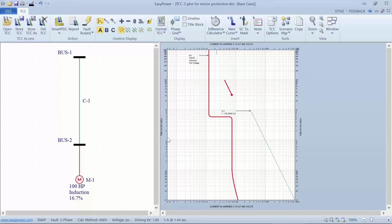If I look at my log scale over here, I see 1/10 of a second right down here close to the bottom. If I go across, any current at this point potentially would cause a fault that lasts 1/10 of a second. What I read in that article is that for any protective devices we have in series with this sensitive or critical load, if a fault occurs at this current, then I need to be coordinated.